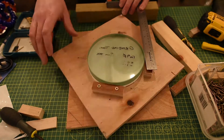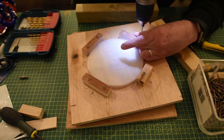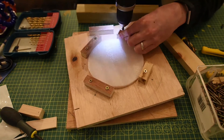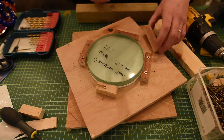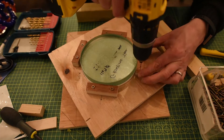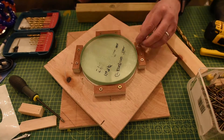This piece of foam is quite important. As I'm grinding — because the mirror wants to be a parabola — I want a tiny bit of give, aiding everything to be smooth and even. If it was directly mounted onto wood there's a good chance it would dig in more. What's called 'hogging' — digging out the mirror at first — is apparently the hardest part, just finding that perfect curve. The piece of wood I removed kept splitting, so I'm replacing it with plyboard, which seems to be a nicer material to work with.